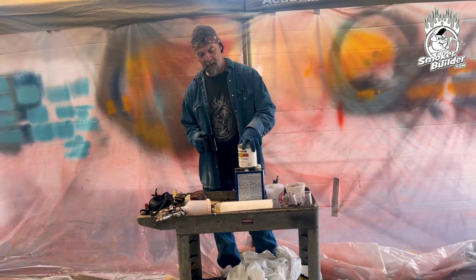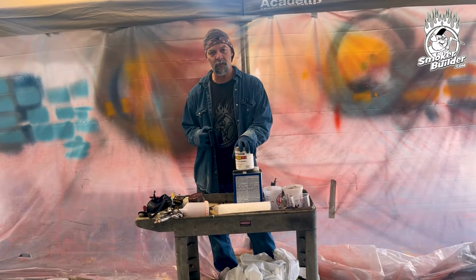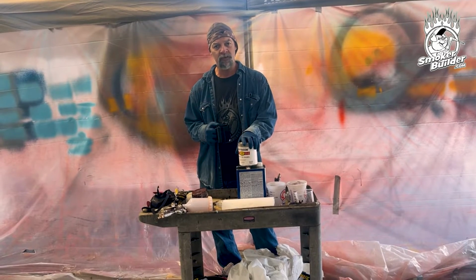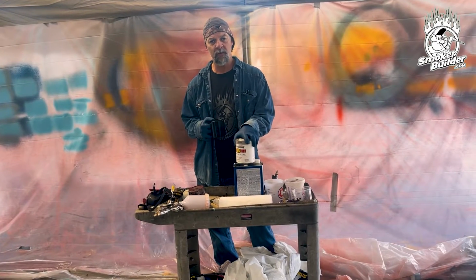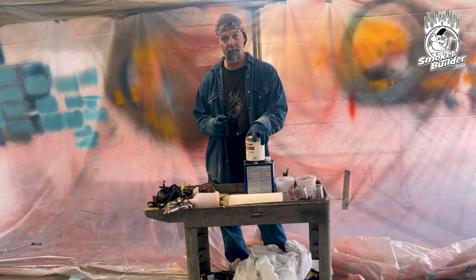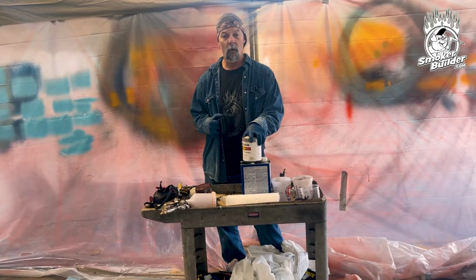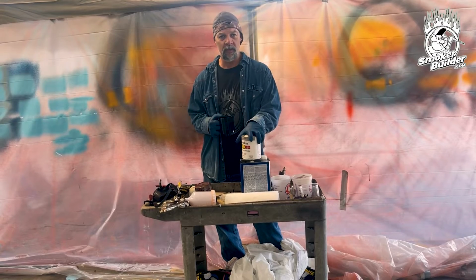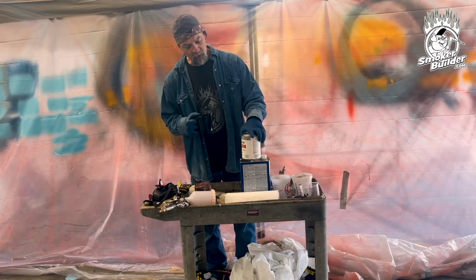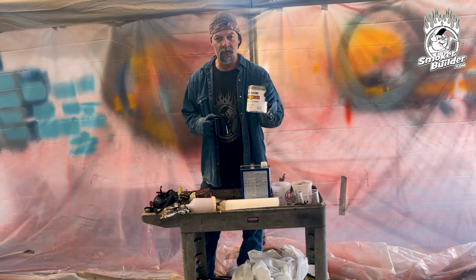What I do like about it is I don't necessarily need a high temperature paint on a drum smoker. If you're going to cook below 400 degrees, this paint works just fine, as long as you have the heat shield in place and the block and the baffle plate in place. Now, if you're going to get up in the above 400 range, I do recommend some high temp paint, or don't paint the thing at all and use linseed oil, because it's going to really develop a nice color and patina over time. So anyway, this paint, you can get this at pretty much any Rust-Oleum distributor dealer.